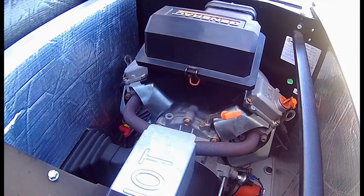Other than that, if you want to stick to a portable gas generator, I wouldn't buy anything smaller than 7,000 watt, and especially an inverter. Spend the money. Inverter, fuel injected, worth the money, because it's technology. It may be expensive to replace the inverter board, like $800. I think Terrell Fixall actually replaced one for $800, if you get a bad inverter board.